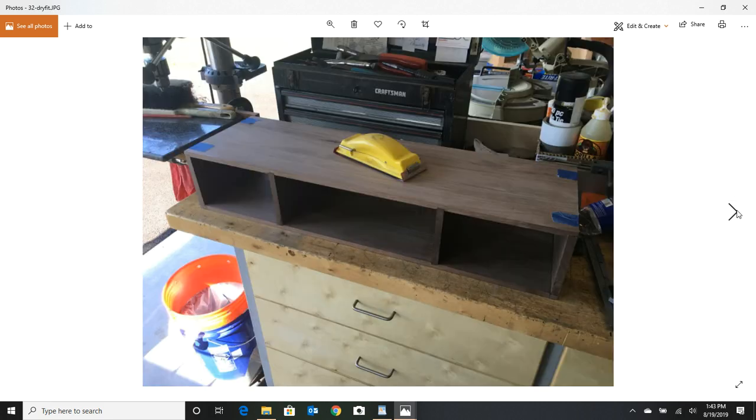Take a squared block and drop it in — you'll know if your layout lines are wrong. If these aren't square you're in trouble because you'll have to build unsquared drawers. When I got done with the dry fit, I noticed the board was a little cupped — I was a little shallow on one of the dados. I had to trim that divider with a block plane, but you're always checking, always dry fitting.